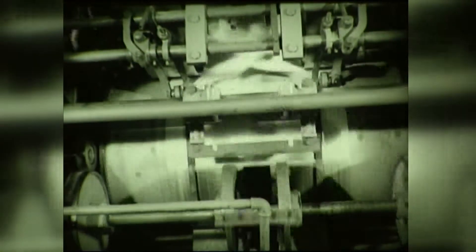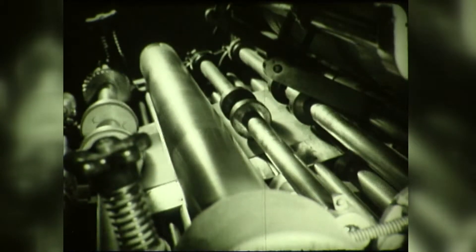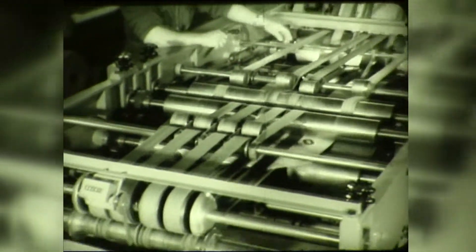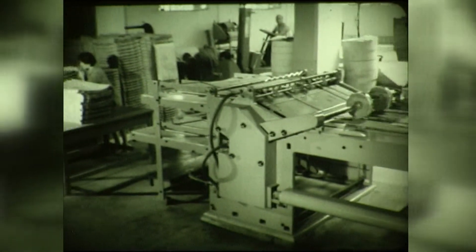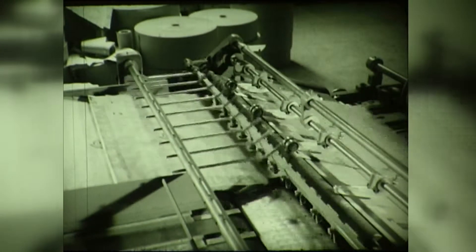The block bottom is folded. The bottom flaps are folded over and pasted. The capping strip fed from a paper reel reinforces the finished bottom. If desired, this capping strip can be printed in single or multi-colour in the same operation. If bottoms are to be formed at both ends of the tube, the Progress 525 paper sack bottoming machine will carry out this task in one operation, one bottom of the sack being fitted with a valve closure. The machine employs two feed tables from which the tubes are alternately removed by swinging suction cups.